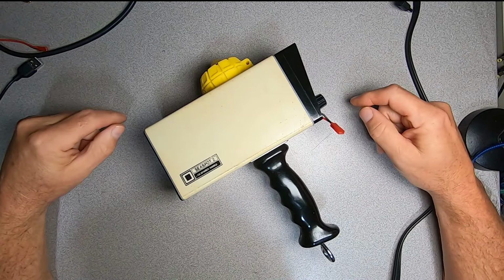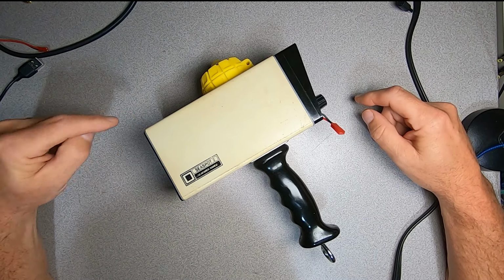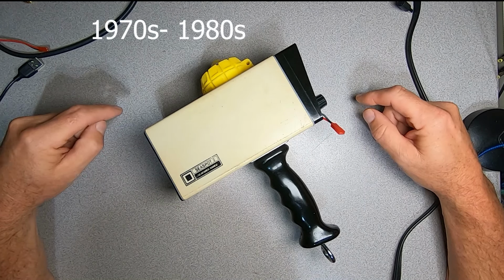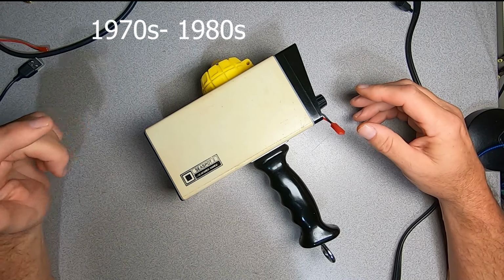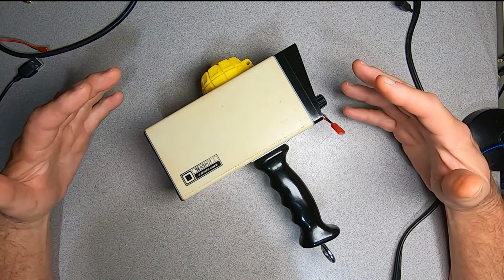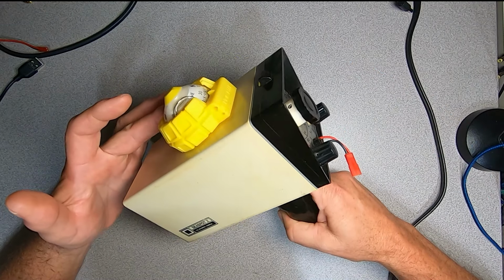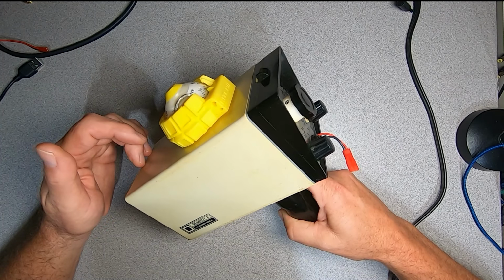Well, let's talk about this handheld marine direction finder, the Seaspot2 by Seafarer. This radio was made in England by Electronic Laboratories Limited in the early 1980s. It is an AM radio receiver with a beat frequency oscillator, 4 long-wave beacons, and the medium-wave AM broadcast band. Now, attached to the top is a sighting compass. The original compass was broken, so I've replaced it with a Ritchie compass to preserve the device's functionality as a direction finder.